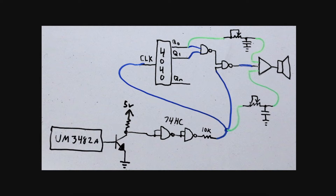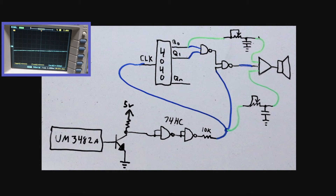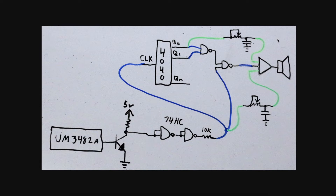By using this melody generator as an input clock on this binary counter — just like when I used a 555 — all the Q outputs are sub-octaves of that original tone. Now I can generate the same melody at lower pitches separated by one octave, so I can combine these signals and make harmony. Because these are square wave audio signals, I put them through a low-pass filter to smooth those square waves out a bit, making them closer to an analog audio waveform. That mixes a lot easier into a single audio tone where I can combine the two pitches and get the harmony. Here's what that sounds like.